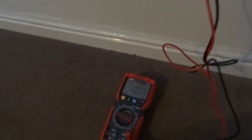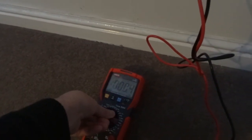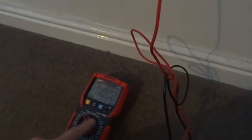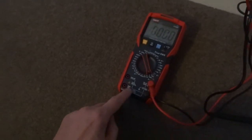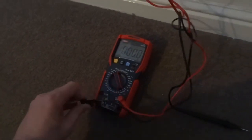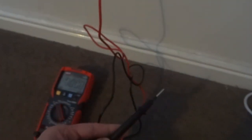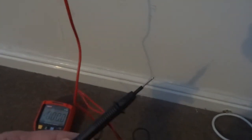And lastly, if you're on the amp setting and you've got your positive lead in the wall, this end now becomes live. If you were to touch that with that plugged in, that would be live — and it can carry 10 amps, usually on a normal meter; this one does 20 amps. So on an amps reading, you'd have it in that socket and that would be live. If you came to this and hadn't swapped your leads back and you're trying to test the electric voltage, potentially you could electrocute yourself by making that end positive.